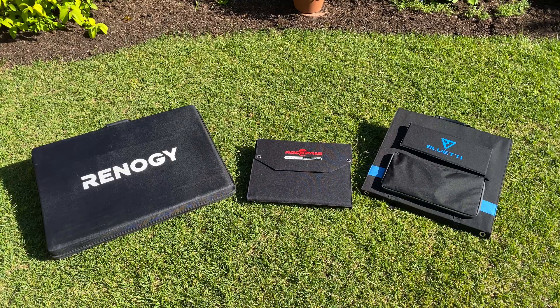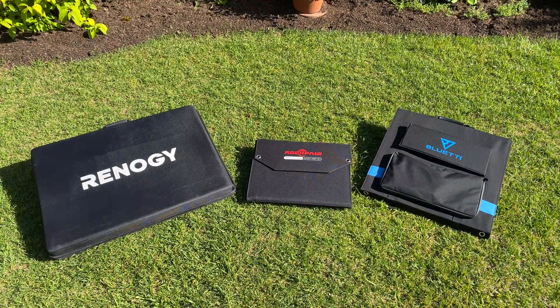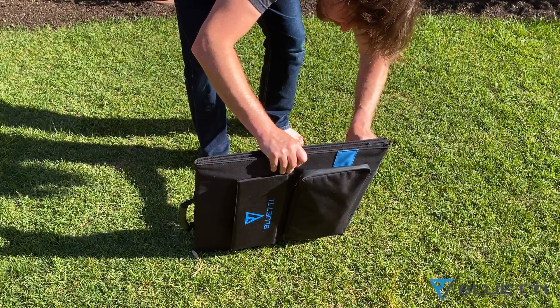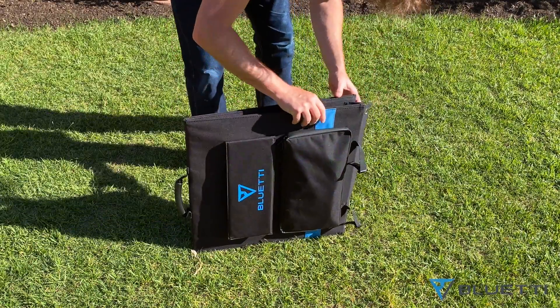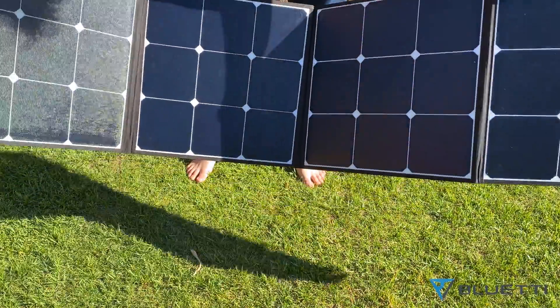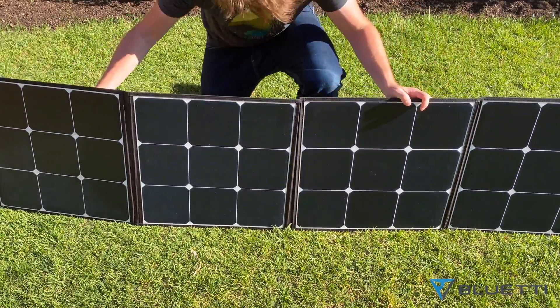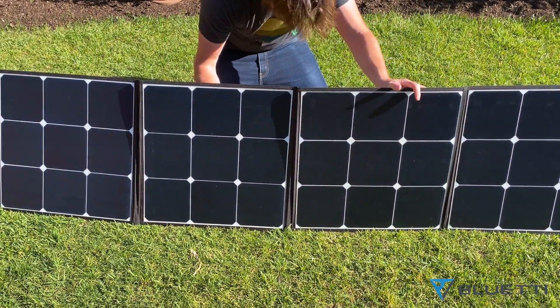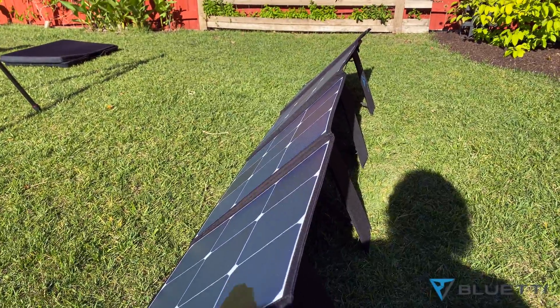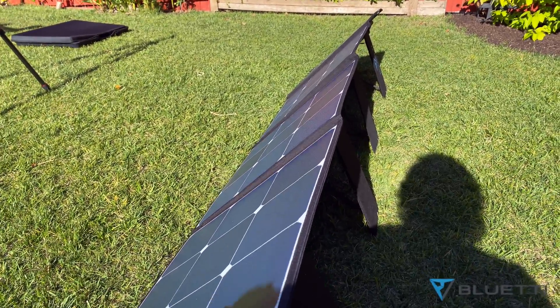It all ends up feeling cheap and diminishes the water resistance for features that nobody will ever really use. The Renogy and Rock Pals are my favorites of their respective categories, but both have major shortcomings and are only 100 watts apiece, whereas the SP200 from Bluetti provides 200 watts and is nearly as robust as the rigid panel with all the convenience of the fold-up. Weighing in at only 14 pounds, it weighs drastically less than the other panels watt-for-watt, while still being rigid with a much larger, sturdier leg base. It also has four legs, one per panel, and each are held in with elastic bands to keep everything standing strong.